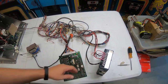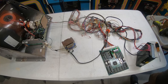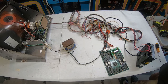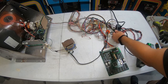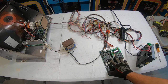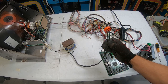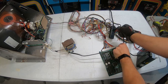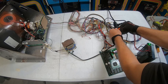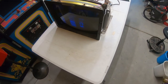Let's plug in the switching power supply first. Here we go — switching power supply is plugged in. We've got a green light on the switching power supply so we're getting power to the jamma board, but there's still no power to the monitor. Let's go ahead and plug that in — here's why I'm wearing the glove: I just have it temporarily wired up to this little plug, I don't want to shock myself. All we're going to do is plug it in and what we're listening for is that high-voltage startup sound on the monitor. All right, I hear it — that's a good sign. Let's come around here and see what's happening on the screen. All right, we got a picture!